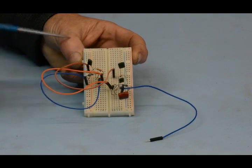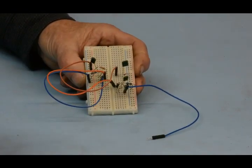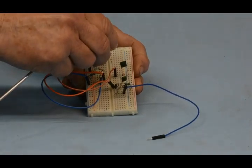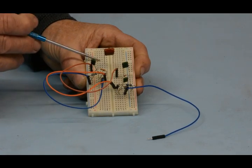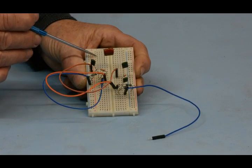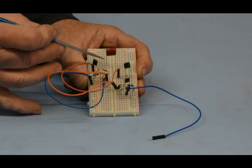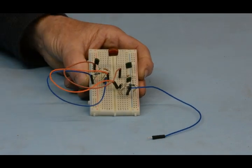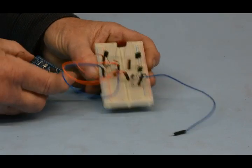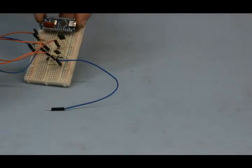The part in the middle, which is divided into two separate pieces, is where you place the components. I've got a capacitor here — I can just simply plug it in and there's a connection made. Underneath the top plastic there are conductive sockets. There are five across and each of those five are connected together, so if you want some components coming together at a common point you can plug them in any of those five holes. The two halves are separated from one another. The holes are spaced such that little microcontrollers like this miniature Arduino can be plugged in across and you can connect directly to that. Very handy for prototyping and proof of concept.